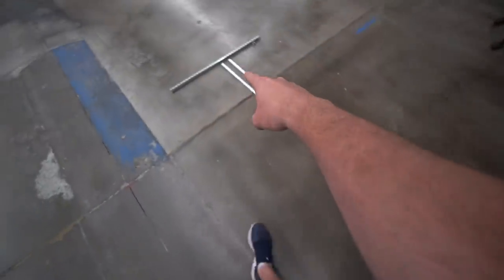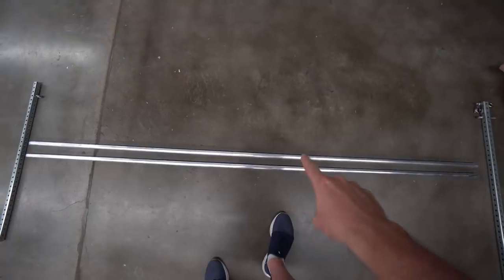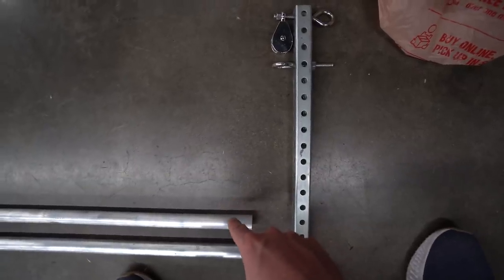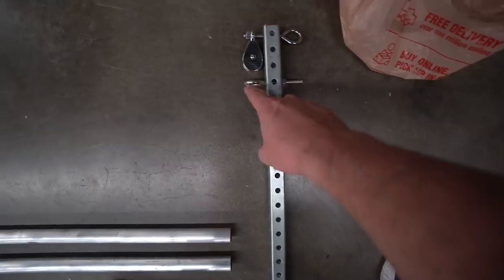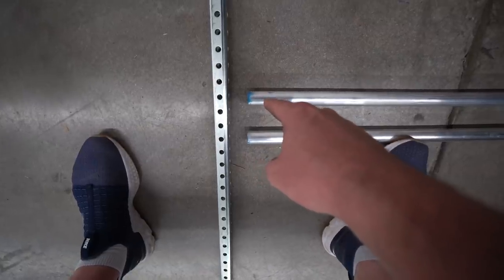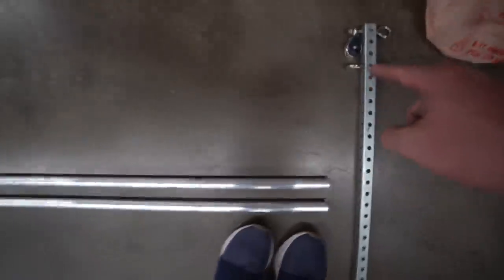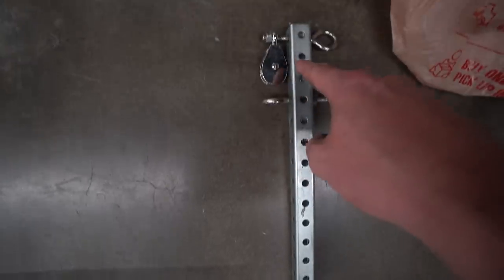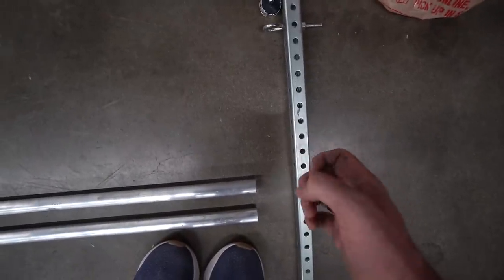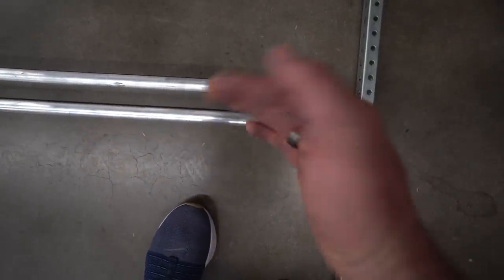This piece and this piece right over here are going to be mounted to a wall — both parallel to the ground. The wire will wrap around these and come up through this eye hook, over the pulley, and down into one wire that I can just pull. This wire will attach here, go up through this eye hook at the exact same height, run across this way, and then through here up into the pulley. So I'll have two wires going into the pulley, clamped together down here — one wire with a pin so I can pull and it'll raise both rods at the same time so it won't get cockeyed.